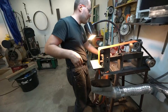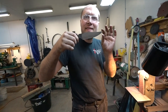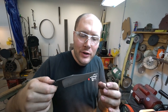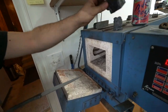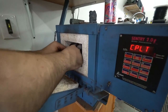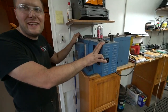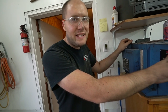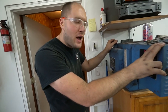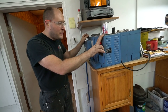Now we can grind the scale off real quick and put it in the tempering oven. Ready to temper. The reason we want to temper it is because right now the blade is kind of hard and brittle. We're going to heat it up to about 400 degrees and take some of that brittleness out of the steel and make it tougher. An electric kiln. I don't know what kind of steel this is, so I'm going to start with a lower temperature. Let's start out by trying to temper it at 350 degrees Fahrenheit and we'll hold that temperature for two hours. See you in two hours.